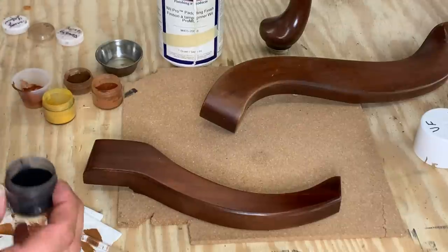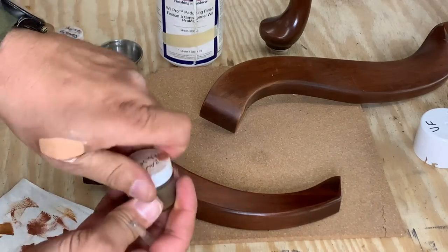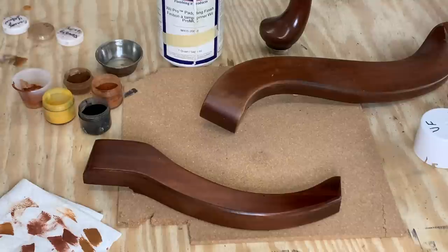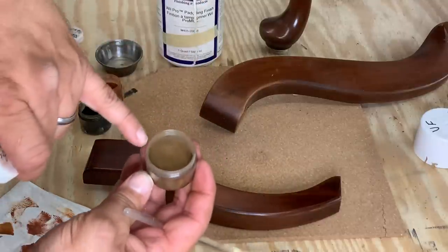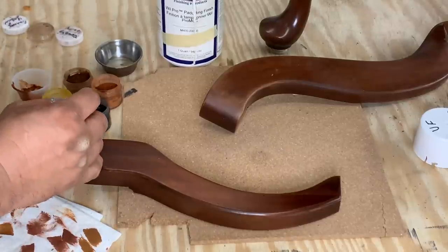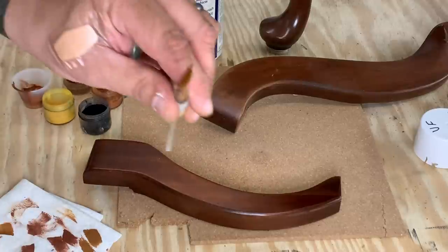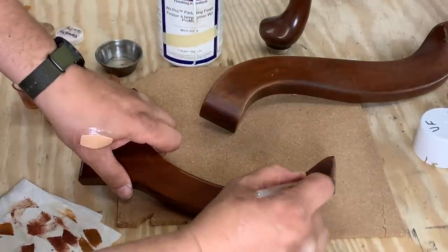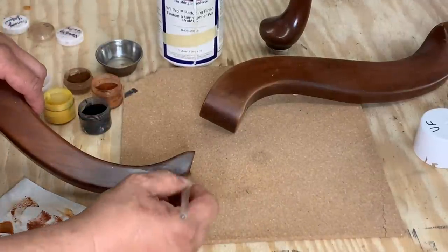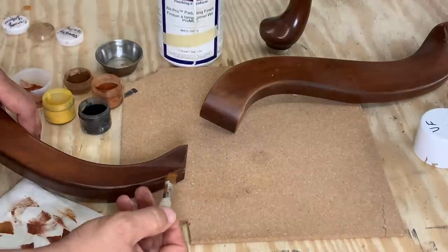I like to see it on the little rag where I wipe off the excess. I've kind of gotten to where I can see it on the rag and know what it's going to look like on the wood. Really, the quickest way to get something darker is to use a dark color. You get there with raw umber, but this is kind of a green, so it's going to take us out of our color sphere further than I want. Van Dyke Brown also kind of has a green hue to it — I don't want to go any green. I just want a shadow. So we use the black pigment. You just want to get a little on your brush, and your brush is fairly dry at this point, so you can just dry brush it on — it's kind of the same process as the finger tap. You're just dry brushing this on, patting that area, just to hide that transition.